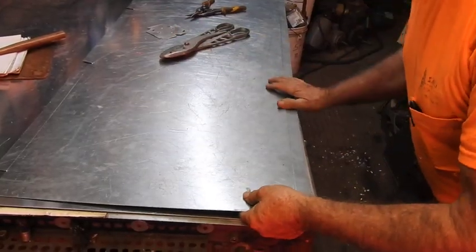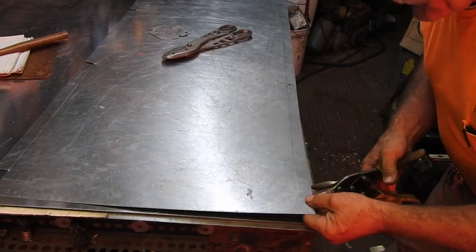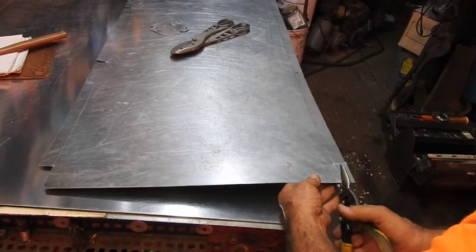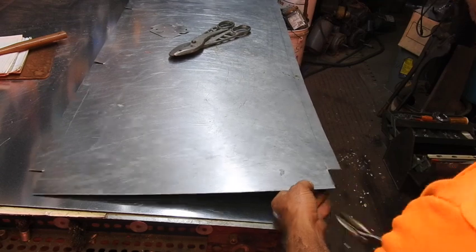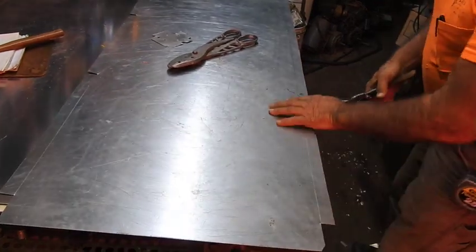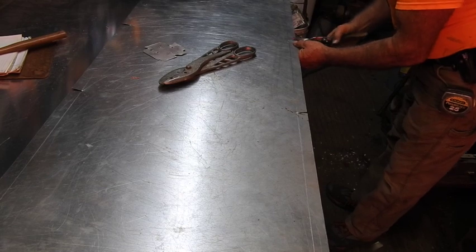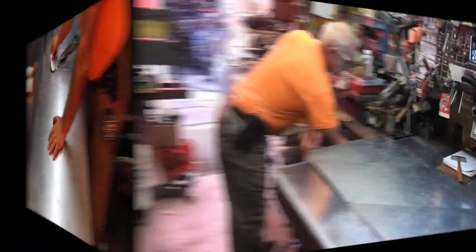The rough is cut out. I've got one side notched — I'll go ahead and notch this side for you here. Remember we've got our Pittsburgh marked on the edge so that comes in one inch. This is going to be our two-and-a-half-inch reinforcement, so we'll cut all the way in two and a half inches and then trim that last half inch off at a 45. Now we come in at our 18-inch mark on the Pittsburgh line and notch that in. Now it's prepared to get a cross brake on and run through the lock.